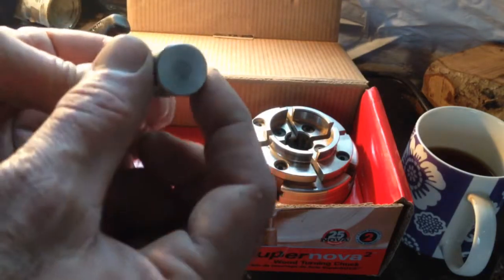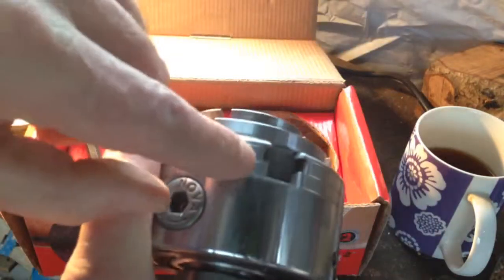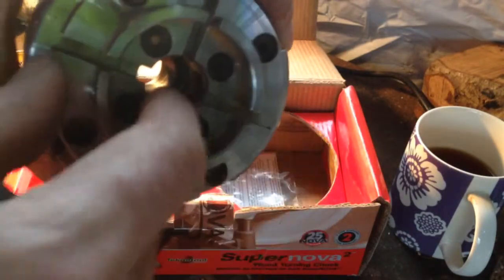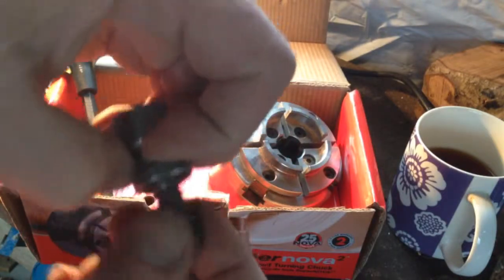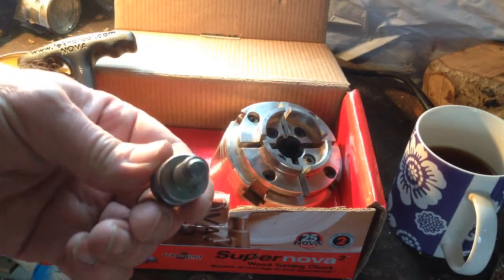They're opposite each other, and there's 4 of them, and they actually meet up with the flats on the inside of the inner jaws, which these are bolted to. And the inside of those meets up with these, and the inner edges of the jaw pieces grip into this recess here, and they hold it very firmly. And on the top you can also see the 4 flats in exactly the same positions, so you can align it. It's kind of ingenious, I think.